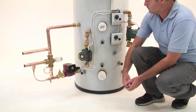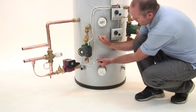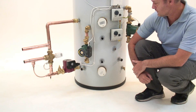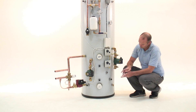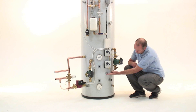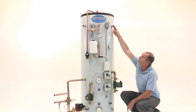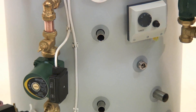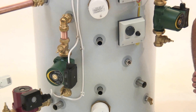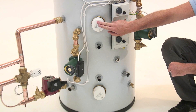The solar input looks after itself. Solar companies provide controls, safety devices, temperature sensors and so on. All we do is fit a coil to transfer the heat from the solar panels. Two pockets are provided — one here for control and one here for a high limit safety. Solar PV — electric solar — can be configured to feed these two high temperature immersion heaters.